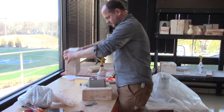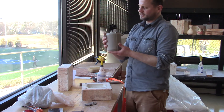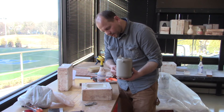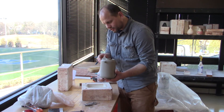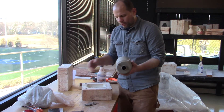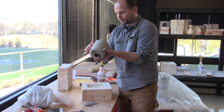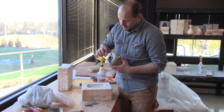My particular cast has little appendages that could break if the mold collapses apart, so I want to be careful with how I separate it. It wants to come apart — so this is going to release pretty well. I'll come straight out and pick out my vessel shape. You can see the seam lines are starting to be more prominent — this is an old mold. I just want to spend some time cleaning this up. You want to consider how the construction of your mold will affect these outcomes. You're always going to have a mold seam — it's just part of the gig.